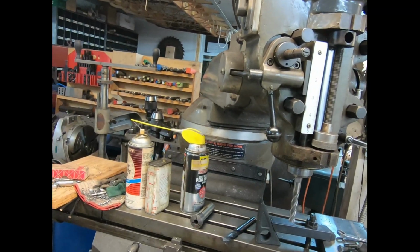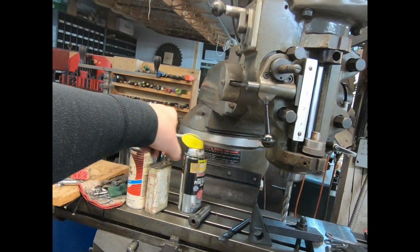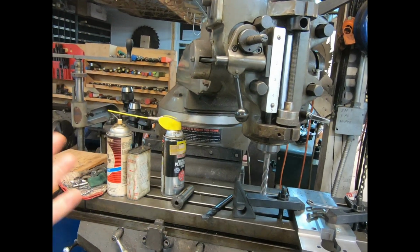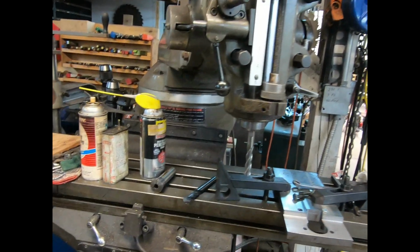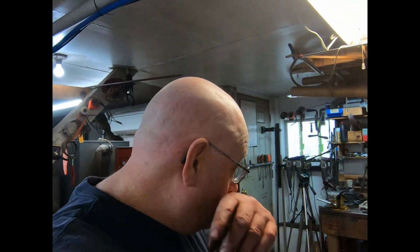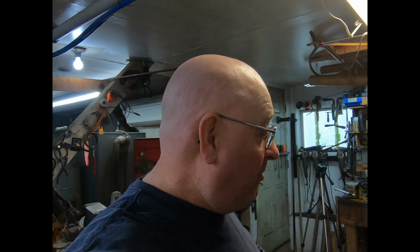And the only time the degree being off a few thousandths would bother is if you actually turn the head. You could technically end up with a hole askew a little bit, but it won't be that much. For what I do for work, she'll be mint. We'll just tip her back to where the indicator says 0 and call it good. So anyway, I'll bring you back in a little while when I'm ready to cut those woodruff key slots.